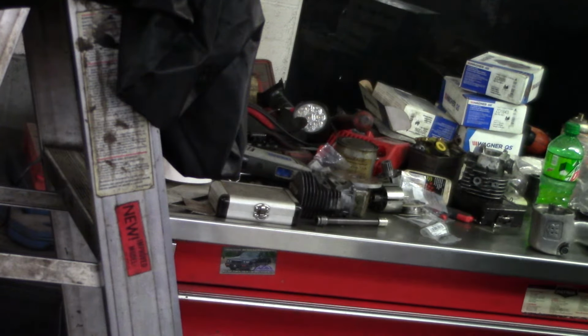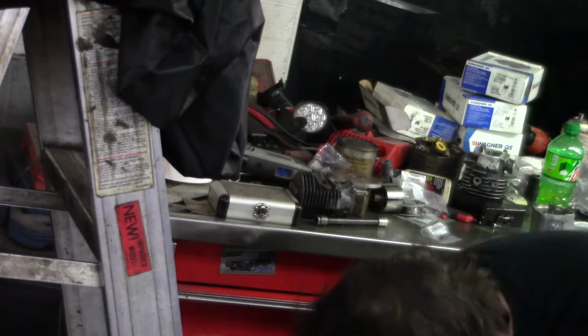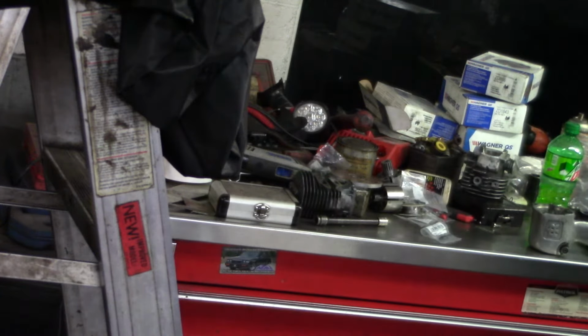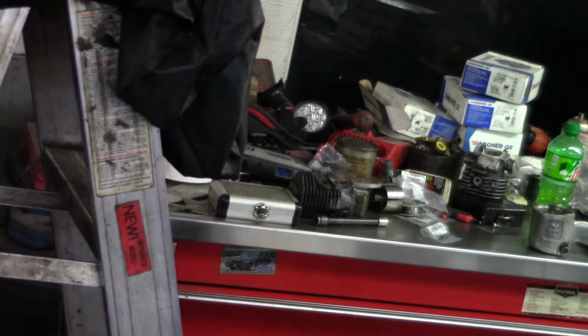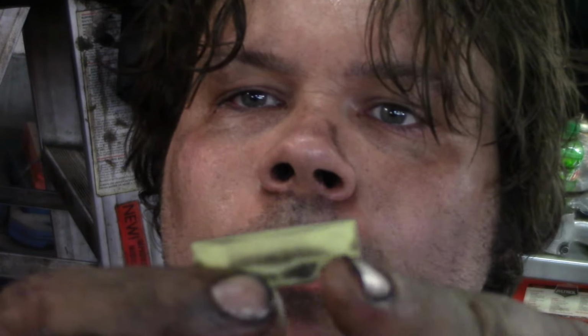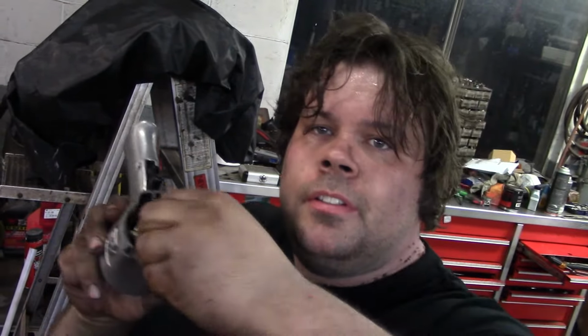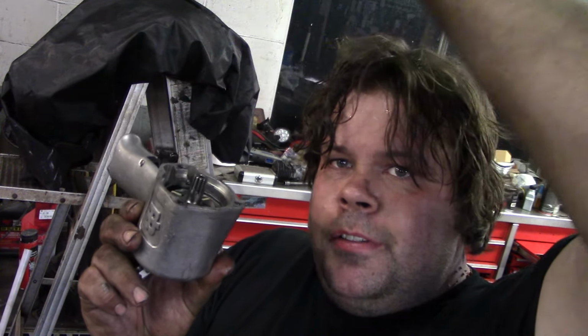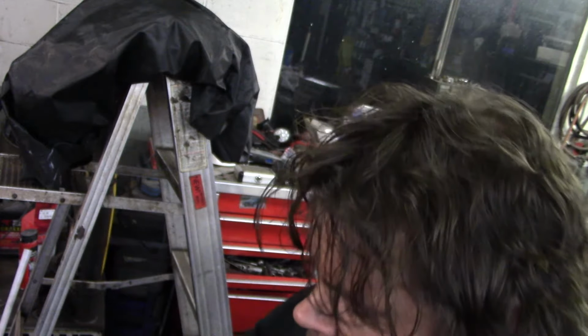Another little trick I'm gonna show you here. Probably bad quality video because usually the vanes that's in your 231, these type, you want this type. See with that little slot in it, it'll give your gun more power. It's a shame that stupid video got all blurry. All you do is just, it's the air motor, just slide that in. End plate.